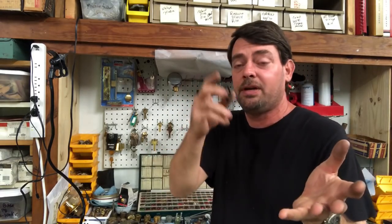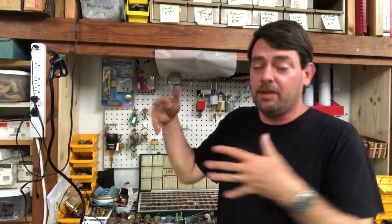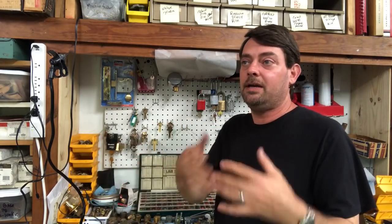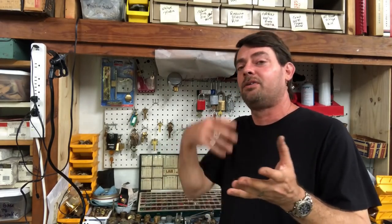I kind of did this video at the same time as my spacer ring video — I'm not sure which one will go up first, so I'll link whichever is related. Spacer rings are a whole separate topic and a whole separate video. But again, if you have any questions or comments on aluminum style cheapy cylinders — I love them because they're so easy to get into when I have to open a vacant building or someone's lost their keys, but for long-term use and security it is best to upgrade to a brass cylinder. Even an LSDA or GMS will have tighter tolerances and will last considerably longer — I'd easily say five times longer. Thanks for watching, and we'll catch you next video.